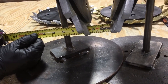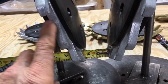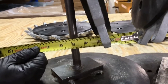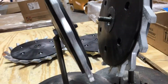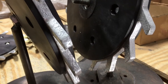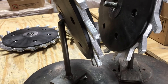We're doing about the same as with the two-and-a-half-inch spacing: from the center of the ring out, center of the rim over to the center of the rim is two and a half inches, right at the bottom of the wheel between them. As these wheels go around, they release soil at the five, six, and seven o'clock positions. As they exit, they leave the soil compacted — not like a straight finger that rooster-tails the soil up behind. This leaves it compacted over the seed.